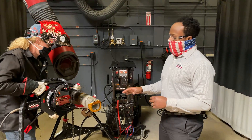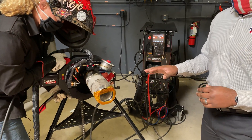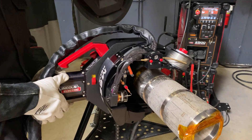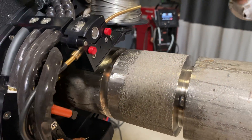What we're going to be welding on today is some four inch heavy wall stainless steel pipe coupons. These pipe coupons feature a J-bevel prep. The J-bevel with the two pieces together creates a U-groove with a closed root.